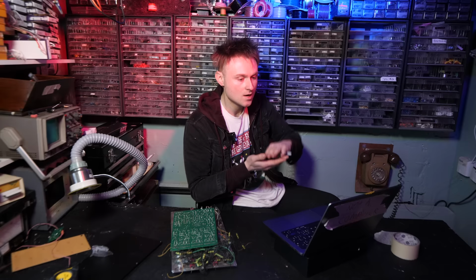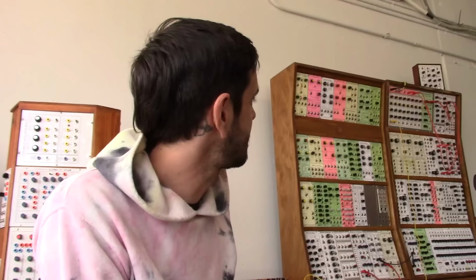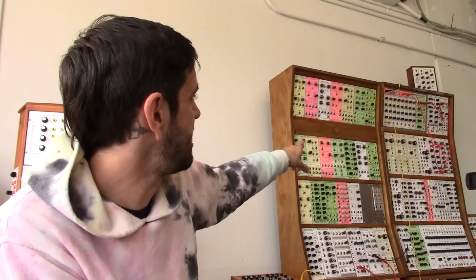So regarding the size of the synthesizer modules, are they all the same size? Are they Moog 5U kind of size? It's not truly 5U. Even within the case, there are some different sized panels. Really? Yeah, I think he just worked with the metal stock that he had on hand. A lot of the modules in the Monster use a pre-drilled panel, so there's maybe 20 holes already in there. And then he built a paper face for whatever particular module he was building, and the holes that he didn't use are covered by that piece of laminated paper. And we have the old smaller cases that these modules probably lived in before he got to the point where he could host the massive case.